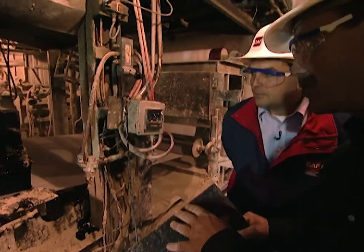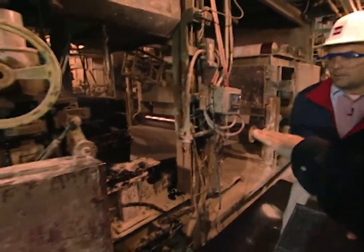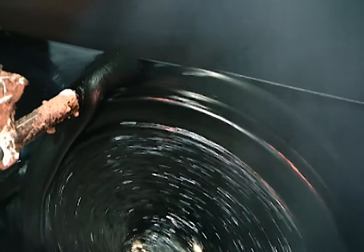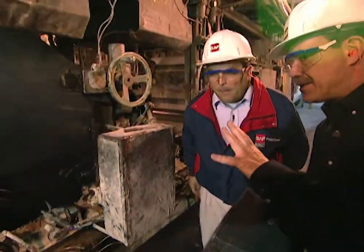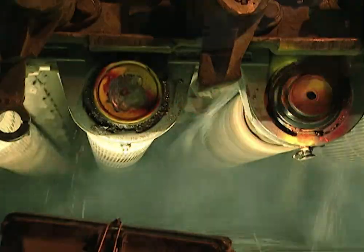The asphalt is running almost like paint, but when you feel the shingle it's pretty stiff, so you know it's got to be hot. The next part of the process coats the bottom side — we coat the bottom side and completely impregnate the sheet itself with asphalt to get a good thick waterproofing. Now all the granules that form the surface of the shingle are being applied.